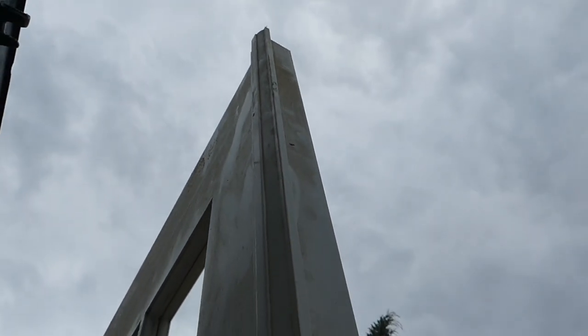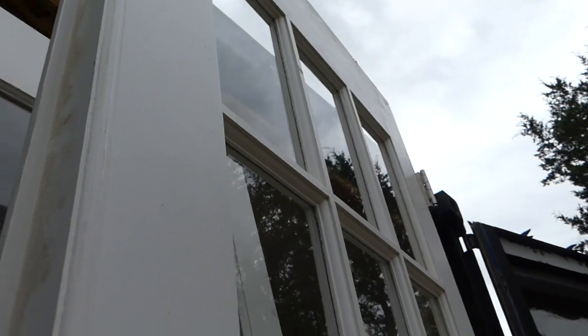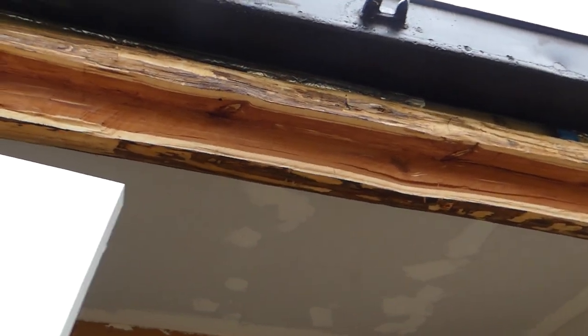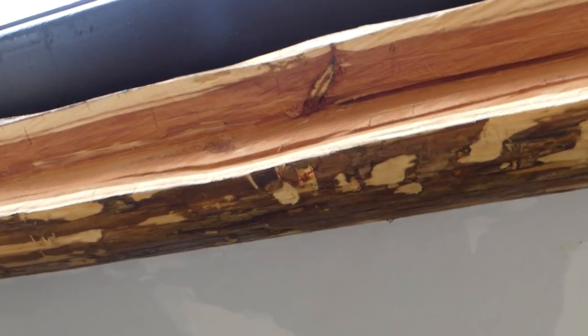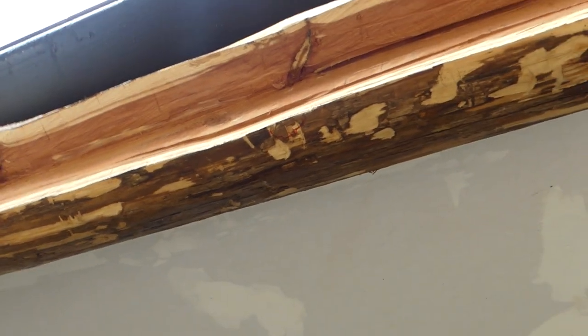All right. So one last thing is the little furring strip between the doors, the weather strip. It adds an extra quarter inch there. So what I need to do is carve it out. Now I could just cut it flush and then it'd be easy, but I decided to carve it out. Why not? So I'm gonna carve it out right where it goes, and that way the doors will sit flush, and we'll do that. So why do things the easy way?